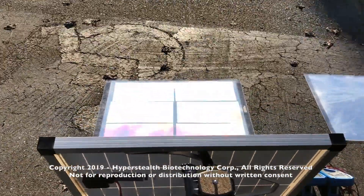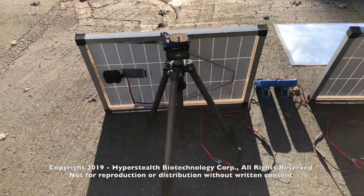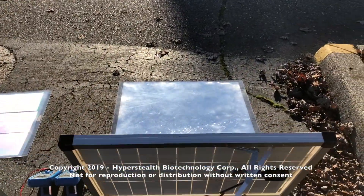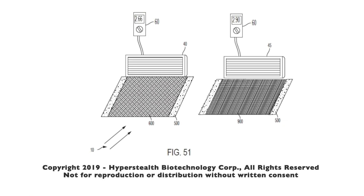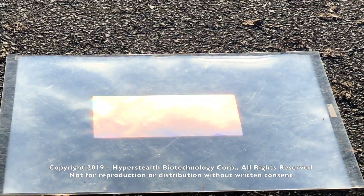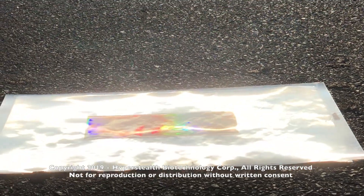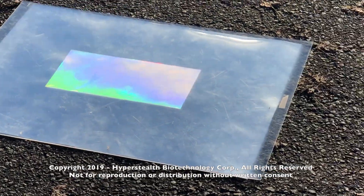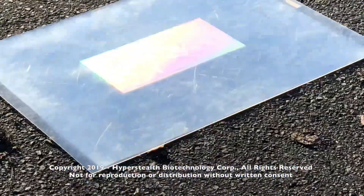This nine percent was only using one lenticular sheet, as I only had a few pieces of double-axis diffraction grating to experiment with. It also occurred on December the 6th, where solar radiation is only about one-third of what it is at the beginning of summer. The double-axis diffraction grating was equally reflective across 40 degrees to the right of center and 40 degrees to the left — equaling 80 degrees total — and about the same 80 degrees in the vertical angle as well, meaning we may not have to track the sun with the solar panel to obtain the amplified output.